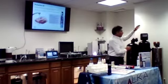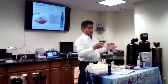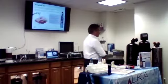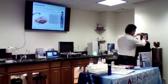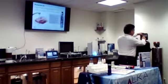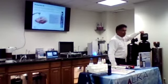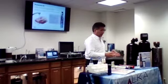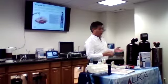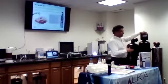Even though sometimes this system gets installed on a house that has 3 or 4 bedrooms and 3 bathrooms, there might be like 15 people living in the house. Imagine, if the hardness in that house or that city is 25, the capacity is only 1,300 gallons. That means that every 1,300 gallons, like I told you, it is going to regenerate. And if there's a lot of people in the house and they use like 800 gallons a day, this one will regenerate almost every day. That will be really hard for the system to take. So we need a bigger system. We need a bigger tank.